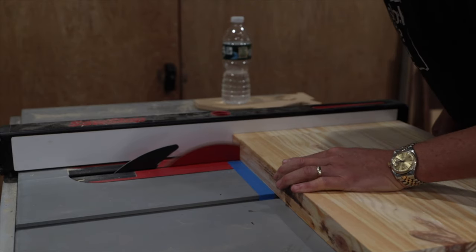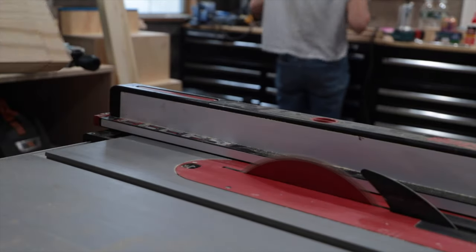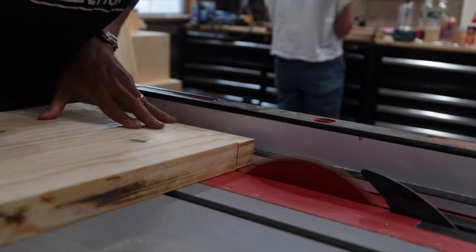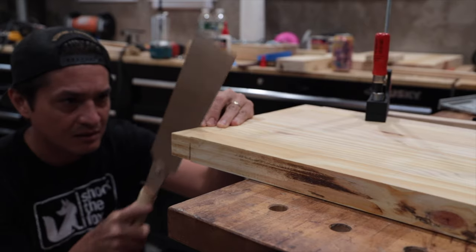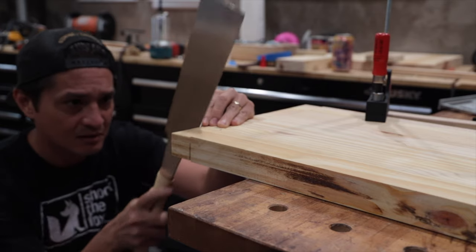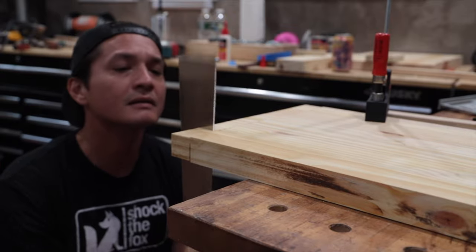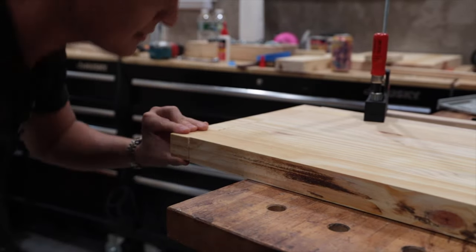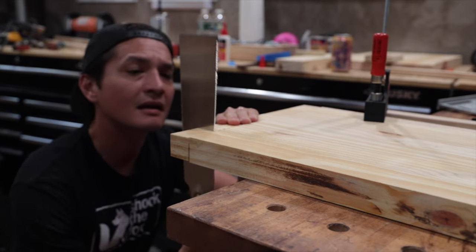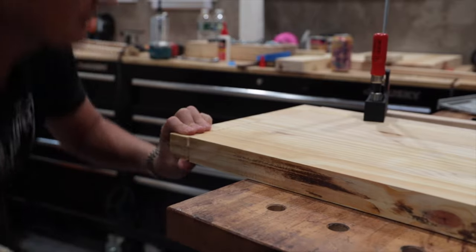While Sam was setting up the template on one leg, I opted to do the other side of the tenon opposite the stretcher by doing a stop cut on the table saw and then finishing it with a hand saw. Since I was in New York for a timber framing event, I also had none of my finer joinery saws. My Ryoba in my bag was a 300mm carpentry saw. Sam handed me this little guy, which unfortunately was missing a few teeth. A couple months after this build I actually gifted her a small Suizan saw so I wouldn't have to suffer through using that one again.